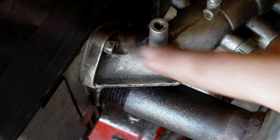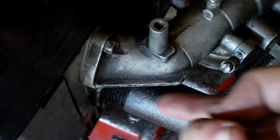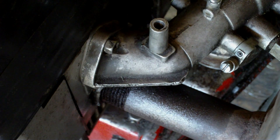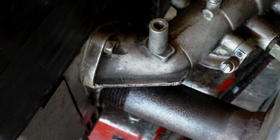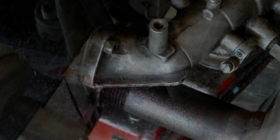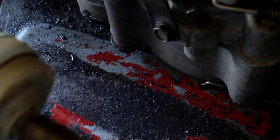Now I've got all the oil drained out. I'll take the carburetor and the muffler off. To take the carburetor off, take out these two 3/8 bolts — some of them have a star drive or a Phillips drive, you can use a screwdriver, a torx bit, or a socket. On the other side there's a linkage. Here's the linkage I'm talking about — it hooks on the backside of the carburetor. This is a 5/16 bolt; I use a nut driver to take that out.